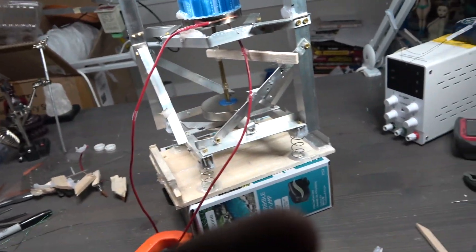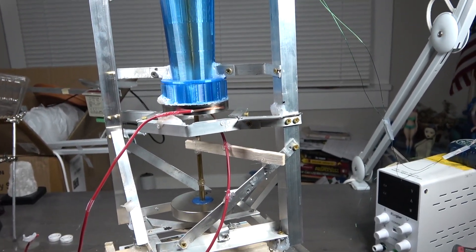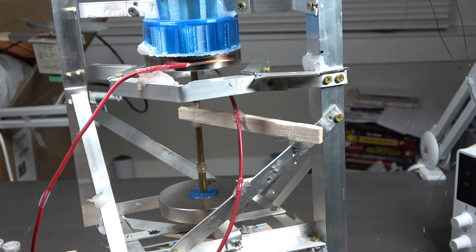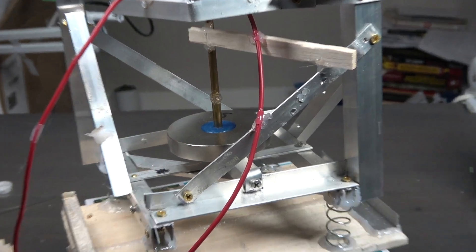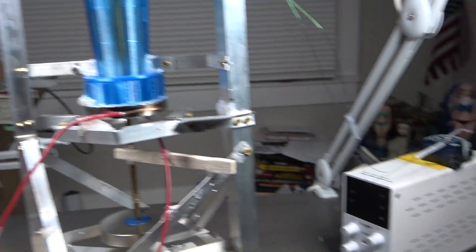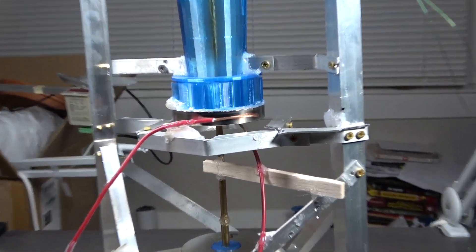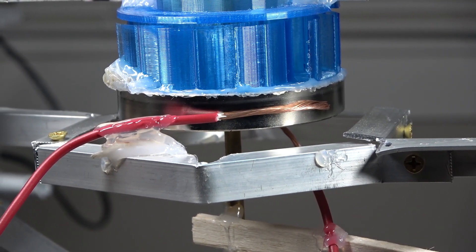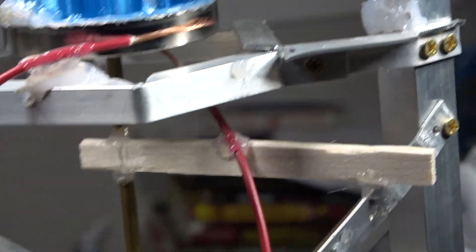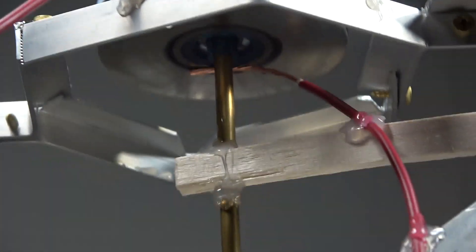The magnet sits on another magnet in a maglev situation. It's basically at the point where it's weightless — I've got it set at that equilibrium point — and there's a second magnet below it in repulsion of the same dimensions. I'm feeding it with a variable power supply, about 20 watts going in. I have a single copper wire — I think it's about 12 gauge — with one end connecting to the equator of the magnet, at the Bloch wall of the magnetic field.